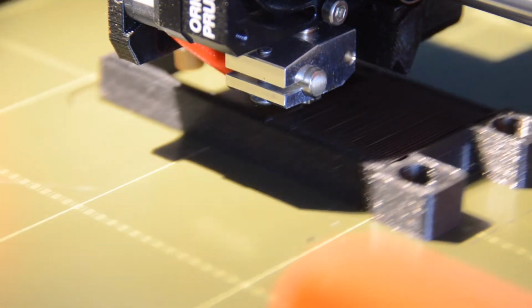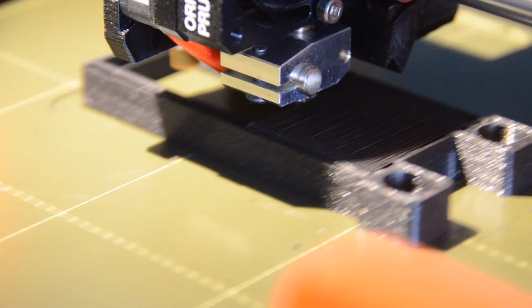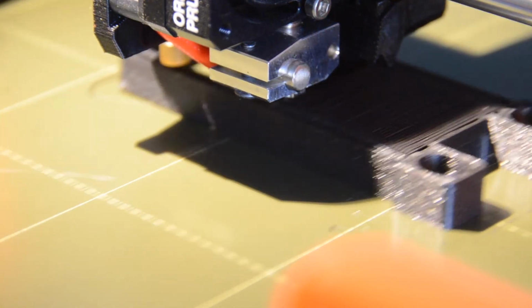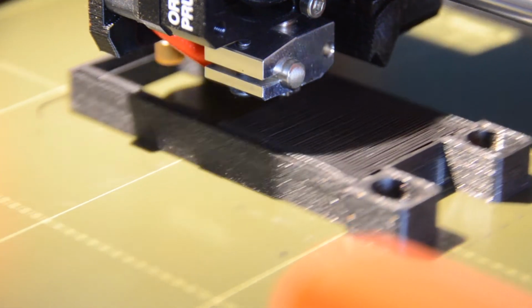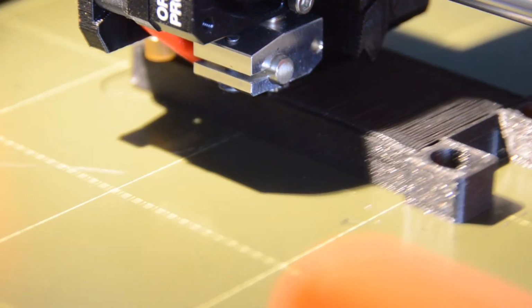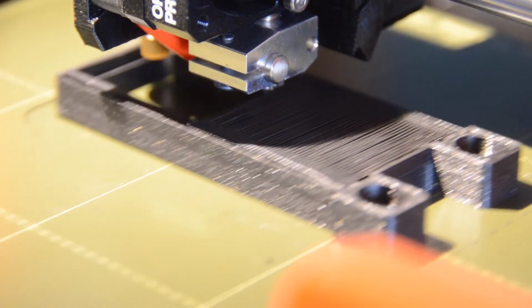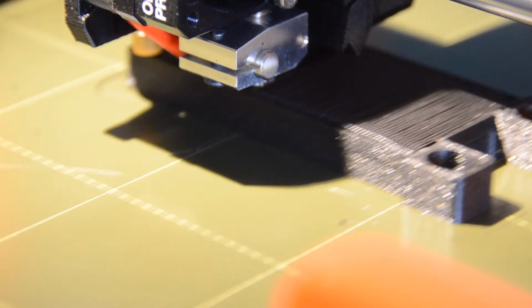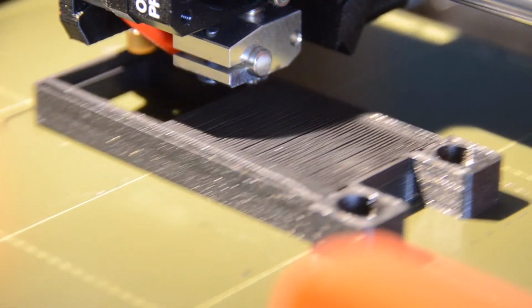Because we added the 0.3mm walls at the very near and very far side of the part in this view, the extruder can actually hang filament between them like a bridge, and it will sag in the middle, but it does at least bond at each end. Because it's not being pressed against anything, the strands don't fuse together neatly, certainly not in the middle. Towards the edges, the surface is a bit more structural.